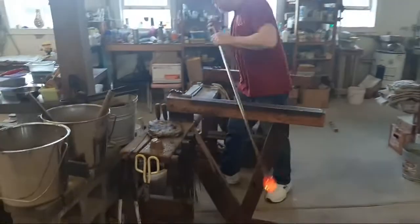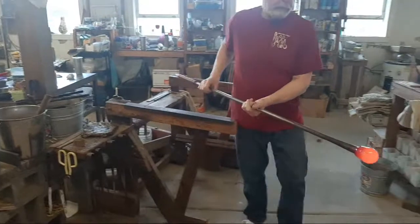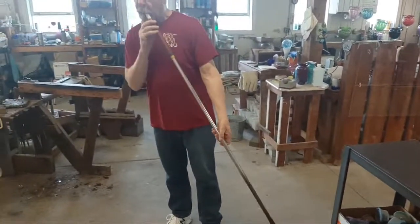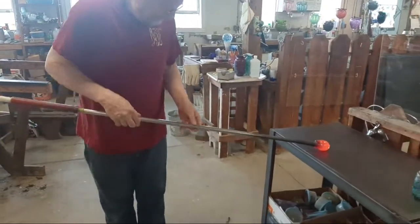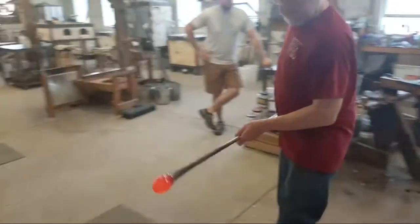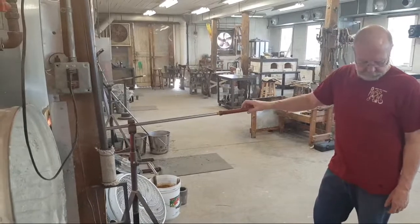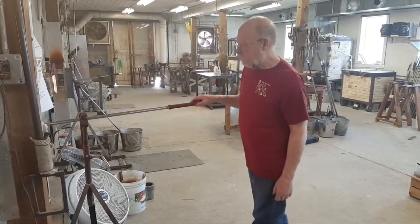Foster's gathered some clear glass over the color aqua he had, trapped a little bit of air into the pipe, and it's blown up now. He's going to marver this and shape it up a little bit. The marver is the metal table we use — in old days, they used to use marble or some kind of stone. He's checking to see how his fit is going to be. He wants to get this glass really, really hot so it'll almost drip down into that mold.